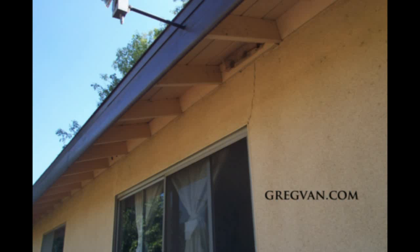A week ago someone asked how they can fix their sagging roof overhang. This was happening for a while when they were using 2x4 trusses — they used them for everything: 2x4 rafter tails overhanging 3 feet, 4 feet. They finally switched to 2x6 when needed. But if you have a house with a tile roof and an overhang larger than 24 inches from the exterior wall to the face of the fascia board, you could actually have a sagging roof overhang problem.